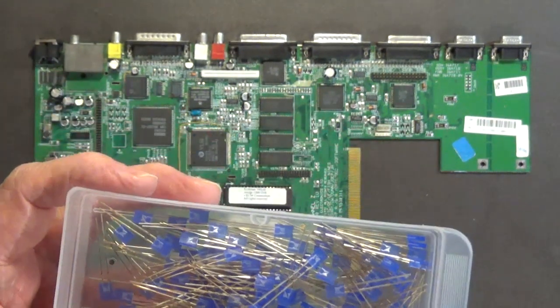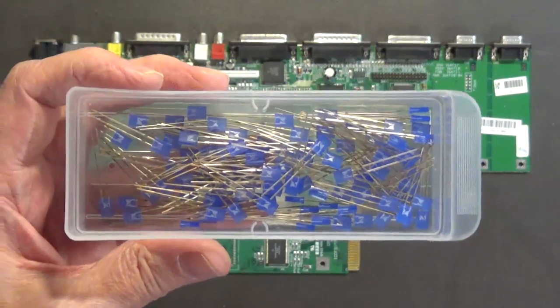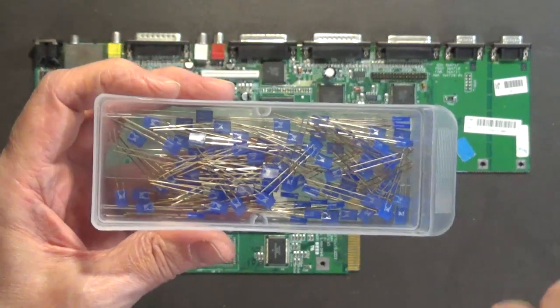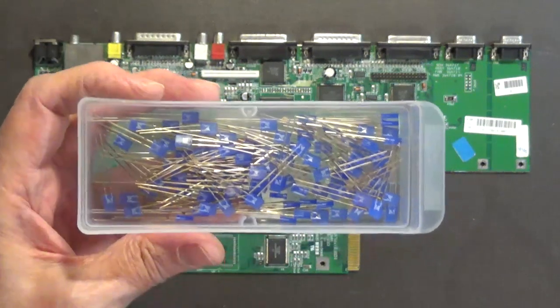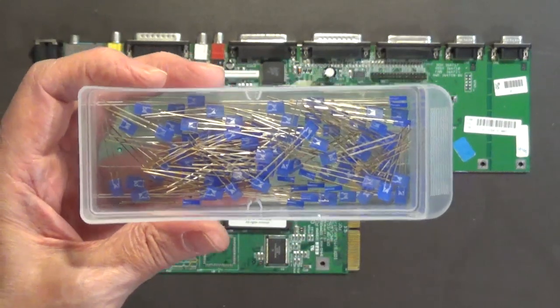And so what I'll do, I'm pretty sure that the resistors for those might be on the LED board. I'm hoping that they are. But I'm going to change them out, and I'll put in 1K ohm resistors. And that should tone the brightness down on these blues so that they have a nice beautiful glow effect. And that's what I want. And these blue LEDs will look really good with that blue case. Oh yeah, it's going to look nice.